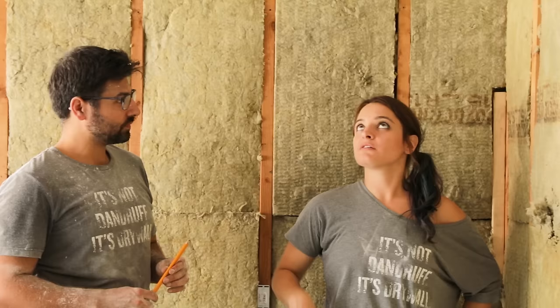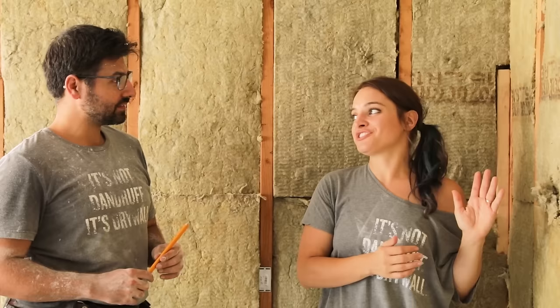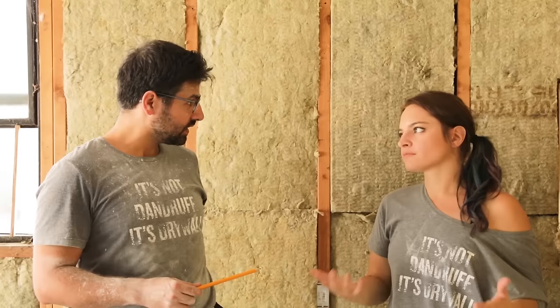Finish the ceiling, so now we can start the wall. Correct. Great, and we can now use half inch drywall, which is so much less heavy. So much easier to hang walls. It's half inch, it's mold resistant, and we can just use our standard 1¼ screws. And now we're finally going into regular 2x4s.